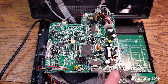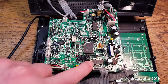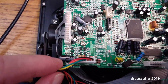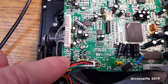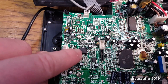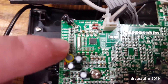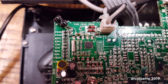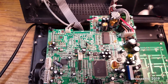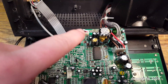The display backlight power is right here. This connects to the motors of the CD player, so this IC is the driver IC for those motors. This is all for the fancy loading mechanism, which they've done with discrete transistors. This connector is for the front panel buttons and the display, and this IC is probably related to those. The tuner sits on this tiny little daughter board, and all that really is is a crystal and an IC — that's all it takes to build a tuner, which is quite impressive. Right here is the auxiliary input. This is the amplifier section, and we'll take a closer look at that in a moment.